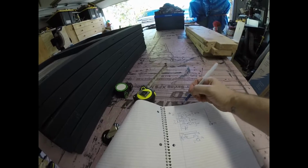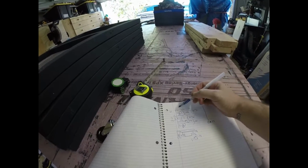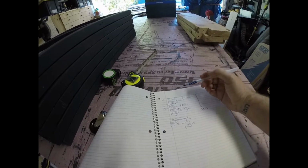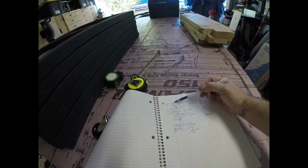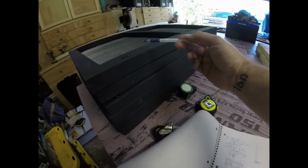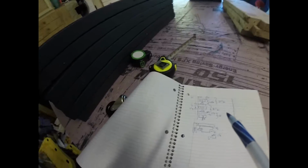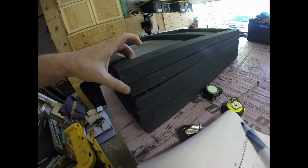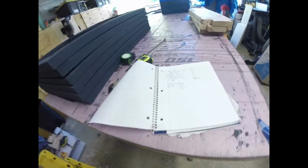So that's about giving me line of sight where I can still look into the tub and it's not too high. I can pull them out. It's at head level. I don't really want it to be higher than that. How I came up with breaking this down was you have the shelf, which for me is 1.5 inches. I want a little bit of a gap between the tub and the shelf because the tubs with the rail that's on there, these screws stick out and you don't want that rubbing on the wire mesh shelf. So I want a gap between there.